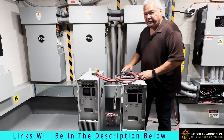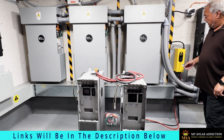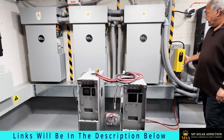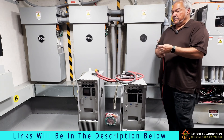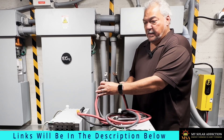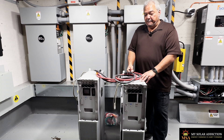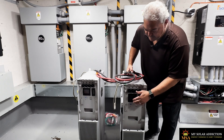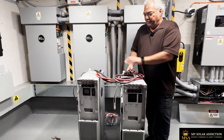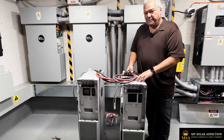We're going to use our charge verter — right here, the old school charge verter, school bus yellow. I still love it. We're going to connect it with the cables from the charge verter, bolt them together, and then charge them up. I could do them one at a time, but I looked at the BMS and the battery voltages are already close, so I'm going to parallel these two together and charge them both at the same time to save time.